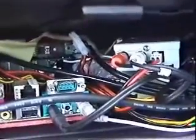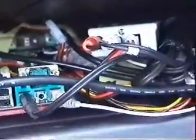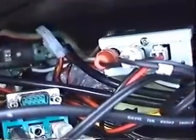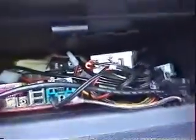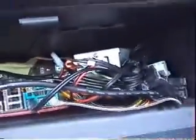And then finally, the other thing in here, which you can't see very well because it's concealed behind all the wires, is the hard drive, and that's wrapped in air bubble foam packing. Now, a concern of mine and lots of other people was that doing so would trap a lot of heat which would damage the hard drive. But thankfully, so far in my experience, it hasn't seemed to damage it at all, and a little bit of testing, the temperature readings I've done, has told me that the drive doesn't really get that much hotter. It doesn't seem to insulate the heat in that much. But it does provide very good protection from shocks in the car, as it's been in the car now for, well, almost 2 years, and the hard drive's still working perfectly, so it's a very good solution as far as I'm concerned. And there you go, and that concludes the tour of the current Carputer state.